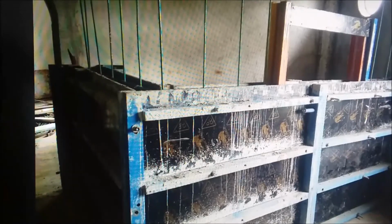they have a sub panel. There's 10 sub panels. That way you only have to run a wire to the sub panel, and all these other wiring runs are short. It's like a one-room house. Saves a lot of wire, saves a lot of time, and gives you a lot more circuit breakers.